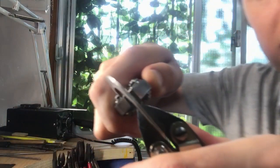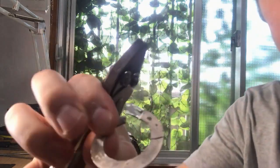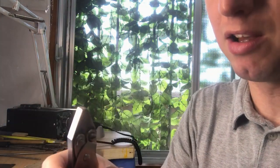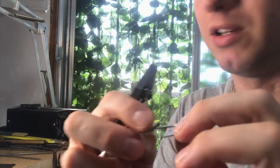I filed it down about three quarters of the way through the metal and then I bend it just halfway — I'm scared of the metal cracking. There's a chance it might crack on the back, so I bend it halfway, flux it, anneal it, and then bend it the rest of the way up to 90 degrees.